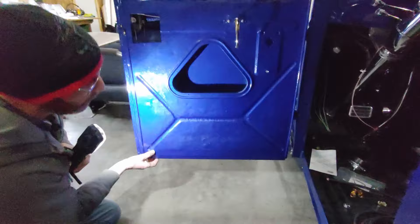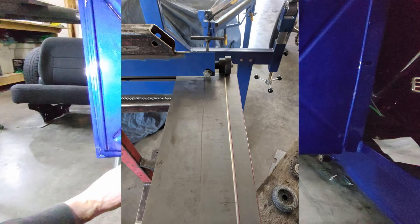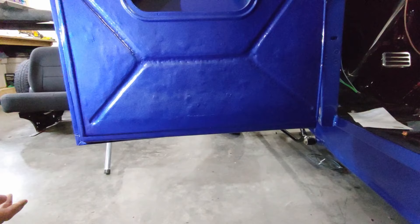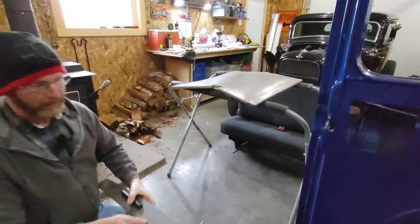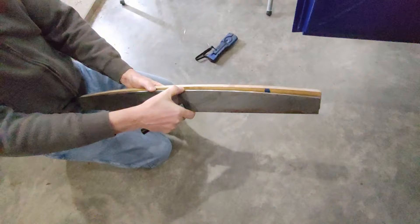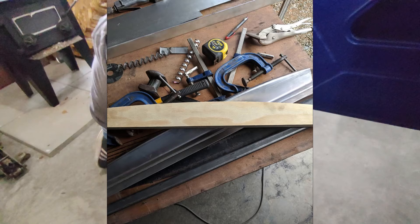You can see it here — you can see my weld line. In order to make that, I took a flat piece of metal, I bead rolled this groove into it, and then I took it to the brake and bent it at 90 degrees. Then for the outer lip, I couldn't figure it out at first, so I made a buck and took that piece of metal and sandwiched it between a piece of wood and a metal plate, then just hammered the edge over. So I've got the piece that hangs down the bottom, and I'll insert pictures so you'll see the process.